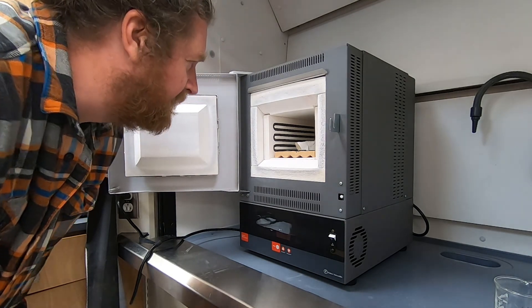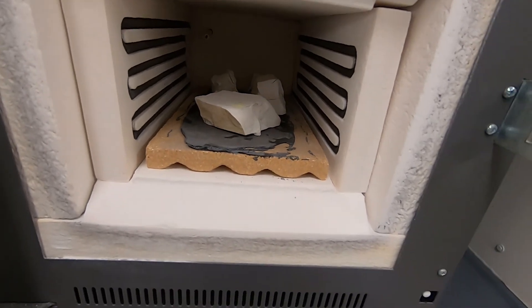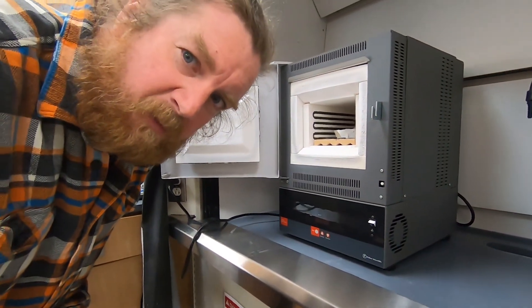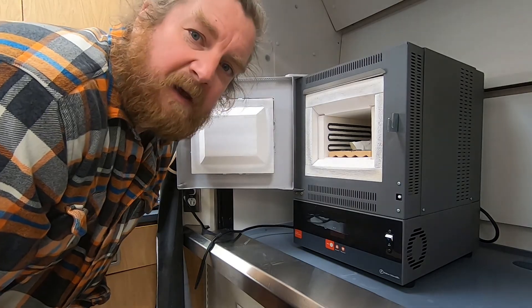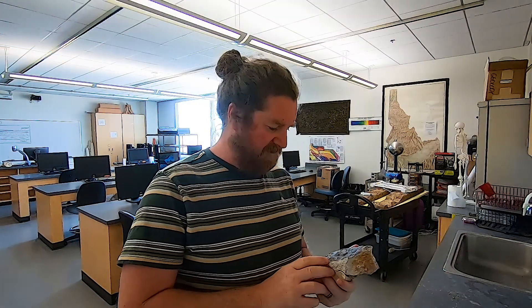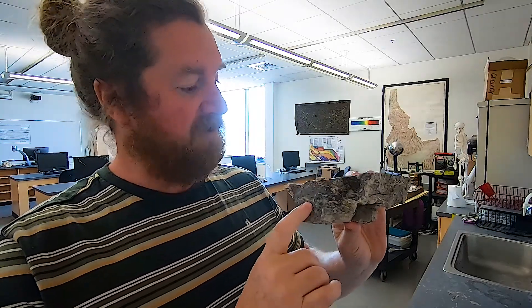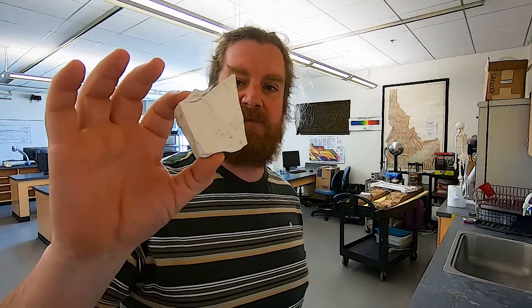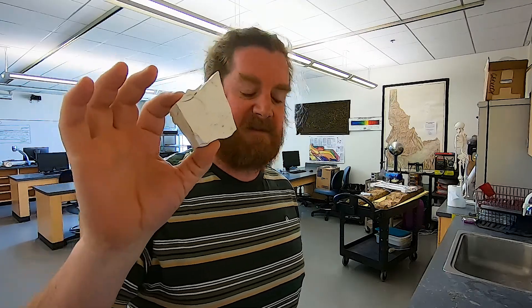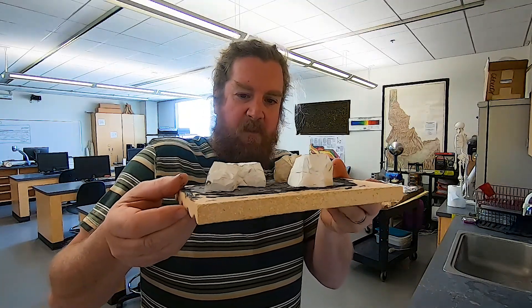There's even some weird yellow where the white-out was on there. What we have is essentially calcium oxide rather than calcium carbonate. This piece is full of fossils, but this is just a regular piece of limestone from the same area where we recovered the stuff we threw in the kiln. These are the blocks of limestone that have been kilned and had that CO2 driven off — so this is essentially calcium oxide, or CaO. Very beautiful, kind of a bright bone white.